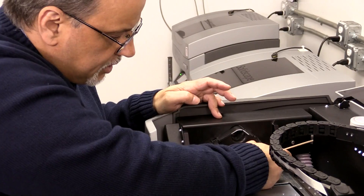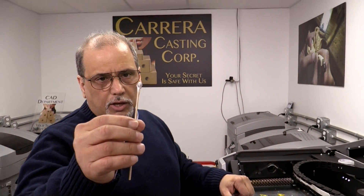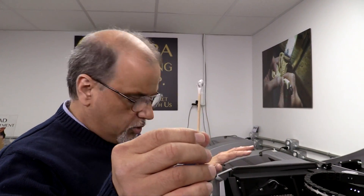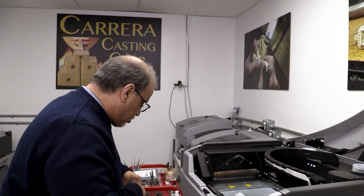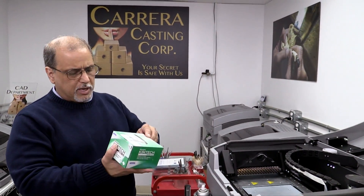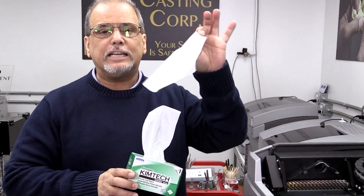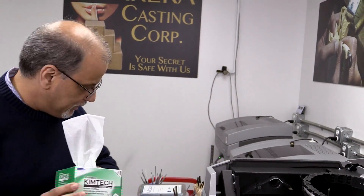Be very careful when you do this — again, these cutters are extremely sharp. If you notice a little residue, that's not bad, but you will know when you need to do this. After the q-tip, throw it away and never use it again. Your next best friend is Kimwipes from Kimtech, provided when you buy the machine. These are lint-free — not like regular paper towels, which flake off and get particulates into your machine that will later gum up your tracks. In an emergency, coffee filters are also lint-free, but get a supply of Kimwipes — they're inexpensive enough.